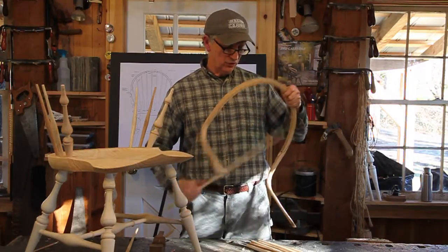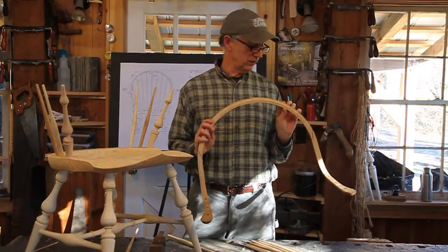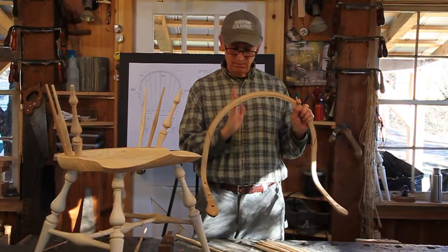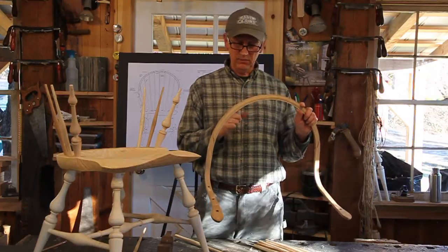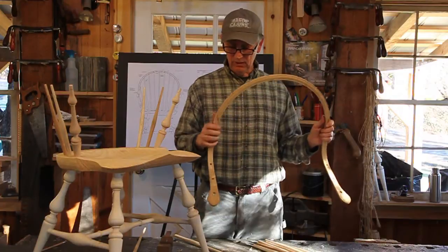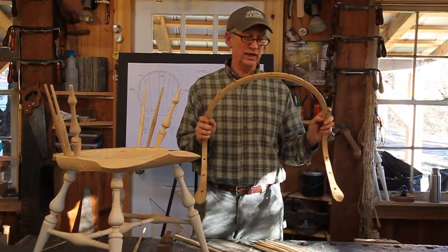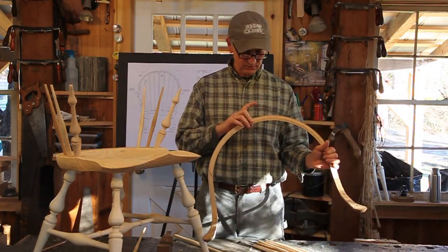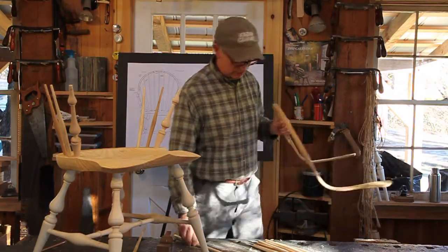But you're just going to make sure that all the spindles, so these spindles out here, these four, are not shouldered. You're going to make sure that they pass through enough that when you're putting it on, it's not going to hang up. So make sure that they'll go up through the hole floating, not sloppy. And we're not going to be dealing with these blind hole spindles yet. We need to know what their length is. So I'm going to make this one fit, and then we'll put it together.